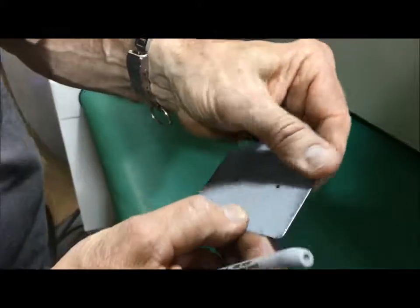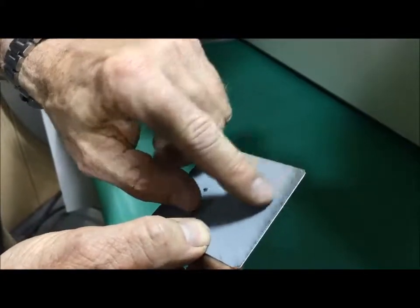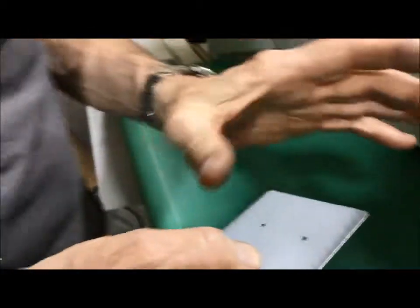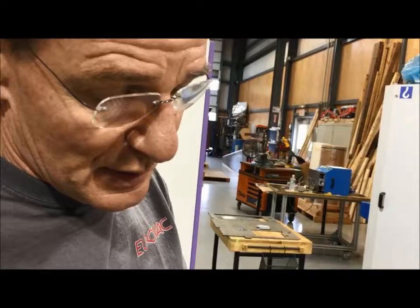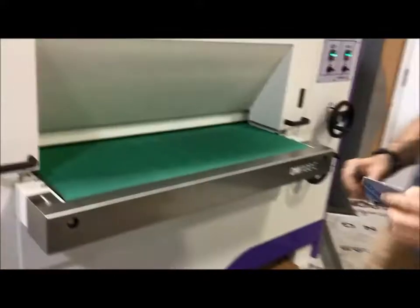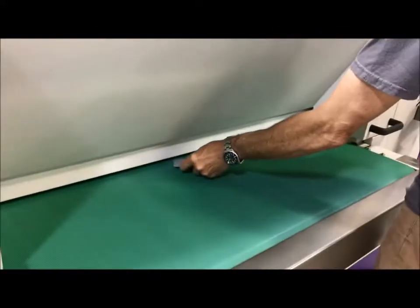This probably would still be an acceptable result. I don't know. See, this is about 40 thousandths off of the edge here now. Almost nothing here. So I don't know how critical this is that you can't touch it at all. At some point, if you really want to have this a crisp surface, you actually couldn't use a process like this. You would have to hit the edge directly. So, and this is the same thing here, only at 40%.